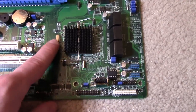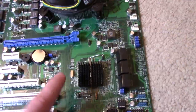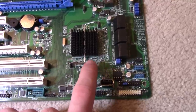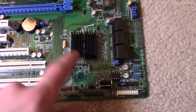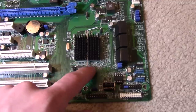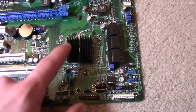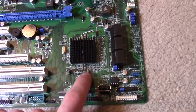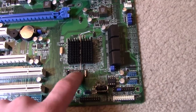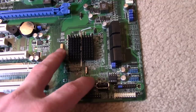There are two crystals here. This 25-megahertz crystal drives the vast majority of the logic — it generates the base clock which the CPU runs off of; all the PLLs are driven off of this. The other crystal is a 32.768 kHz watch crystal for the real-time clock — it's always on, powered by the battery when there's no mains power. You might think this low-frequency crystal is just for the clock and not needed, but that's actually not true. If you look at the datasheet for this PCH — freely available on Intel's website — this is used to generate the SPI clock for reading out the data from the BIOS chip. So if this crystal is not running, the code won't get from the BIOS chip into the PCH and the system will do nothing. Both of these crystals need to be working.